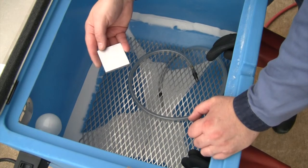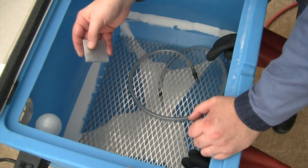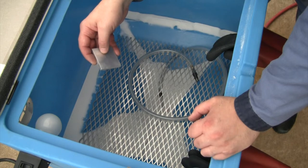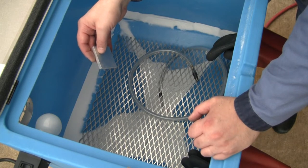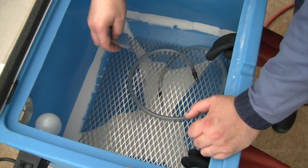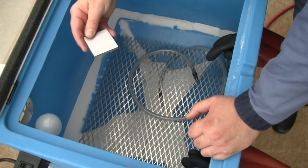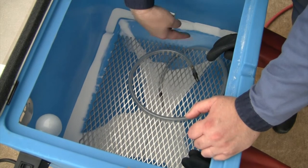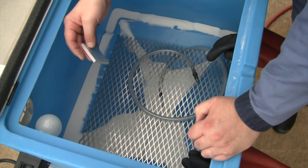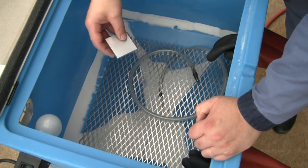The good news is it seems to be working pretty consistently — did that whole side in just a matter of a couple of minutes. My issue now is the screw doesn't seem to be sticking down in the bottom of the cabinet anymore, so the hose is moving around. Let me get that hose secured properly. But yes, I think this new gun is working — it's not just filling up the tube, it seems to be moving media the way it's supposed to.